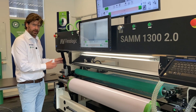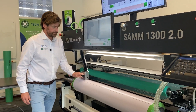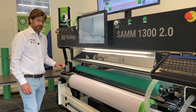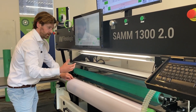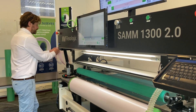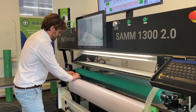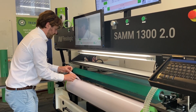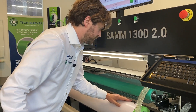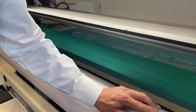What I'm going to do is use my cutting knife here — the rotary ceramic blade. That's going to cut through two layers of tape, very straight because it's mounted on the camera beam of the machine. No damage on the sleeve, because it's a ceramic blade that's rolling over the sleeve, and it also has an adjustable cutting depth. A very easy and safe tool. So now I peel off the overlapping part, and since the ceramic blade is actually mounted on an angle, you get a perfect seam butt-to-butt join, as you can see here.